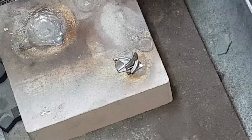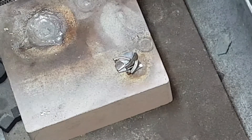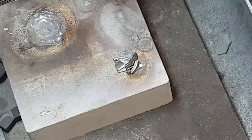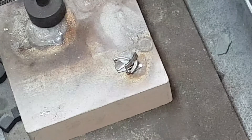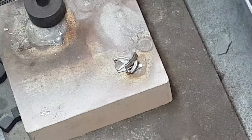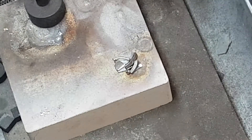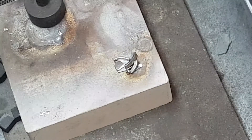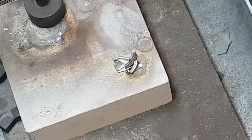I had this little cap made, which sort of prevents oxygen from getting in. This is good for platinum and palladium — after the melt has gone down, you cap it and reduce the amount of oxygen that is sucked into the metal as it turns from a liquid form to a hard form. That's one tip I use. Another way you can do it is with a crucible — use another crucible and stick that over the top.